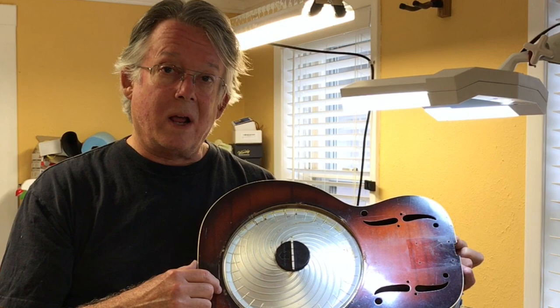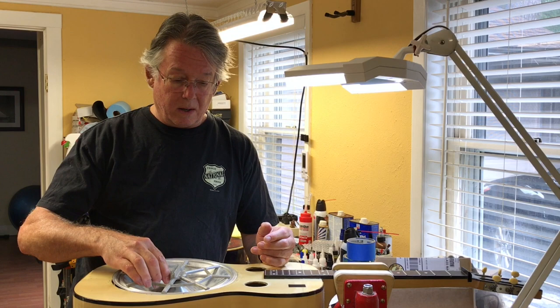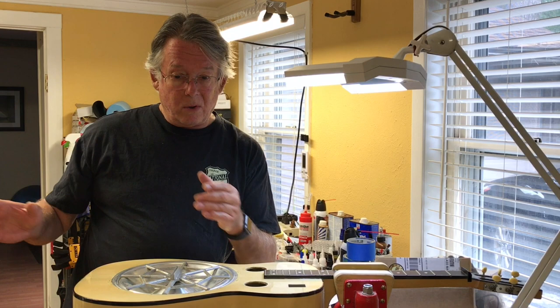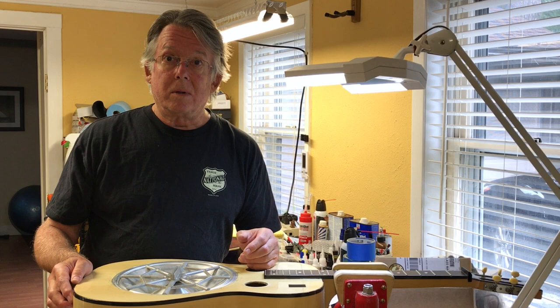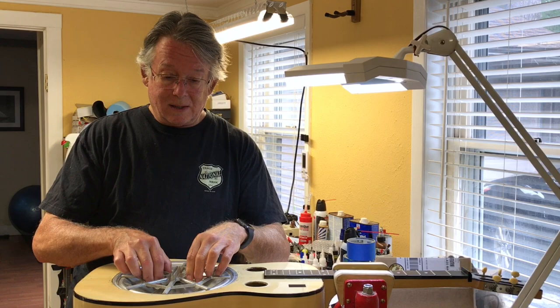So there is a big difference between the two. When we pulled the cone off of this guitar, we found this dobro doesn't have a round recess — it's oblong, which means the original cone was jammed into this space, making it really impossible for it to resonate the way it should. So before I put the new cone and upgrades into this guitar, I've got to take out the router with the rabbiting bit to slightly widen the recess to make this viable for a new cone.